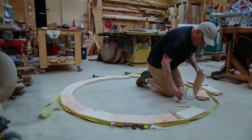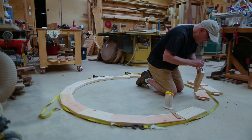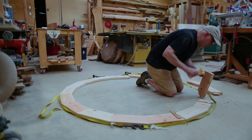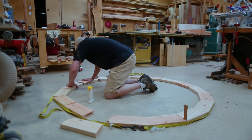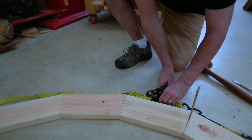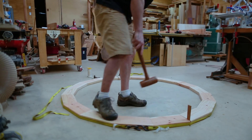Now I could glue up the two arches within the ring, so I did one side first. My ring has 18 segments but my arches only need 8 each, so 16 total — I have two extras that are just spacers in the ring. This means the legs will be at an angle and won't be vertical. I let the first side dry for about half an hour, then did the other side. I could tap the joints into place and use a long strap as a band clamp to hold everything together.